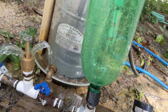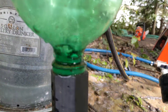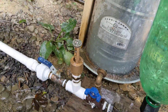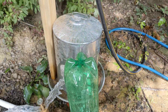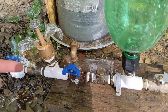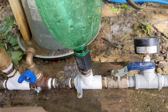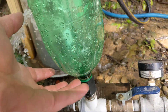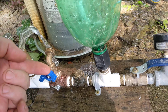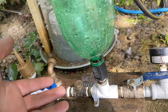Someone asked if we keep introducing air will the pump stop working. You can see it's mostly air — all the water has been pushed out — and it's clearly still working. Efficiency may actually increase at full pumping capacity, because all the water that gushes in has inertia and friction to deal with, but if it runs into air, which poses no effective resistance, that slug of water can more easily be accommodated after the backflow preventer.